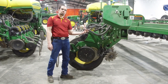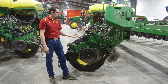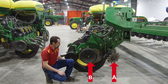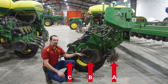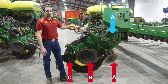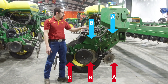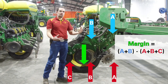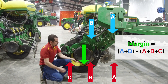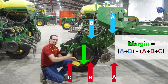To answer how to set the downforce, first we need to understand what the system is doing as the row unit is traveling through the field. All the components on the row unit — such as your row cleaners, double disc openers, closing wheels, and any fertilizer application equipment that engages the ground — will all be pushing back up on the row unit. If you have seed boxes, smart boxes, or any other fertilizer attachments up top, that weight is pushing down on the row unit along with your downforce system. When you set your active downforce or downforce margin in the cab, you are setting the amount of load you want to see carried on the gauge wheel as you're traveling through the field, which is measured by that sensor.